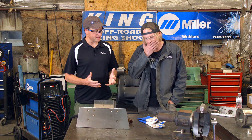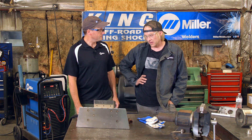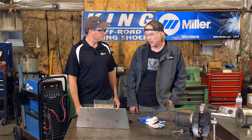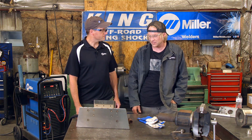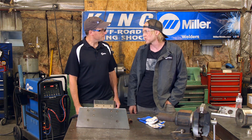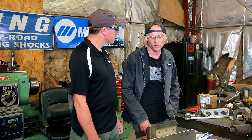What are some of the tricks with welding stainless? Do you put any special components on the TIG torch to help with gas coverage? It's just very sensitive to being clean and being shielded. In a perfect environment we would weld it inside of a chamber, but we obviously don't have one for the piece and in the price range that we sell it in. It doesn't justify being built to that degree, so we just use a standard inch and a half diameter gas lens. The biggest amount of coverage you can get typically produces the best weld when it comes to stainless. It's got to have excellent fit up and it has to be just extremely surgical clean. Any dirt, grime, anything other than just beautiful, polished, clean stainless doesn't weld very well.